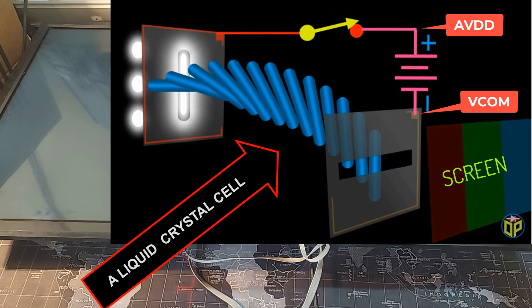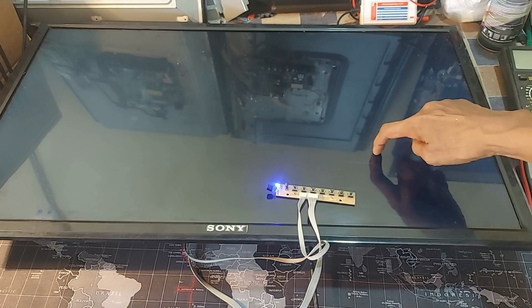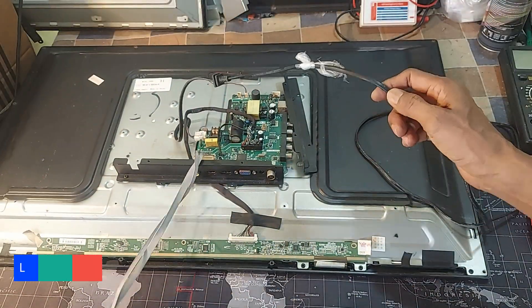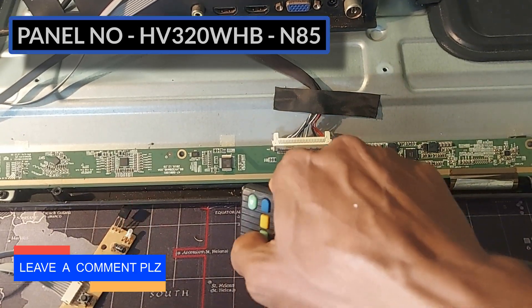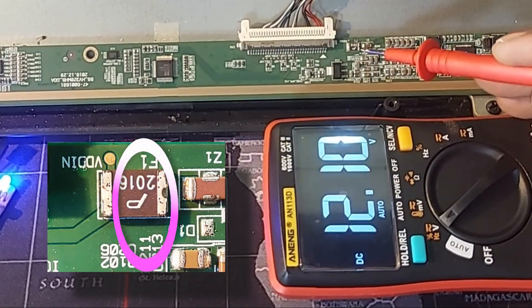There are some basic level videos on this topic — you can watch the video from the link in the description. There is no light and no picture on the screen. So stay with me for 2 minutes as I show how to repair this LED TV panel. The panel number is V320 WHB N85. Now let's get started. The panel's power supply 12 volts is okay.